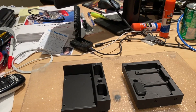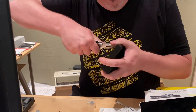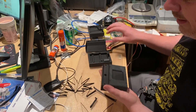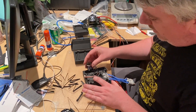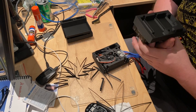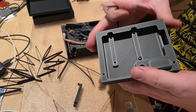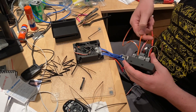This is actually one of the funner steps — the 3D printer has to put in filler material and what's always fun is when you grab it and it comes out like a ribbon. This is the bottom half that's going to mount to the robot. We take the Rage Bridge and it tucks right in here, you take your receiver and it tucks right into this corner. The top piece has four holes that line up to the four tapped holes on the bottom of the Castle XLX2, so that just clicks right on — tighten it down, it's beautiful. These cables feed into this slot.